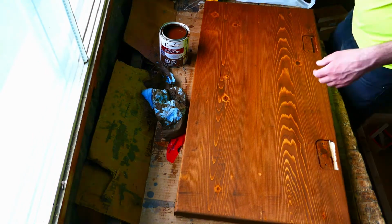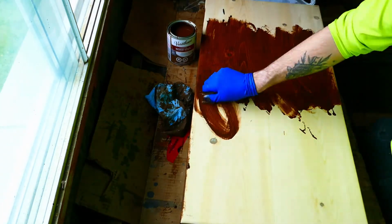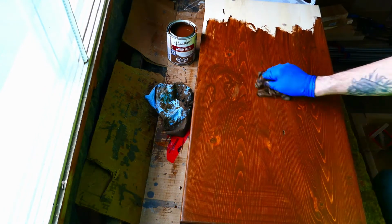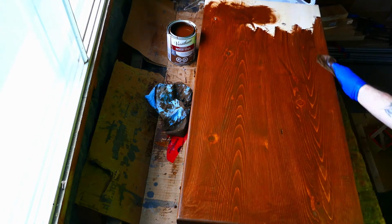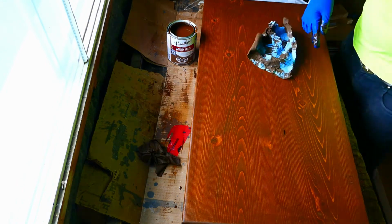So the stain I'm using is an oil-based stain, Varathane's Ultimate Stain in American. Yes, American is the color. It worked well. Wipe on, wait 3 minutes, then wipe off the excess. Since it's an oil-based stain and I'm coating the top with a water-based poly, it's best to leave the stain a full day before adding poly on top.